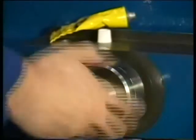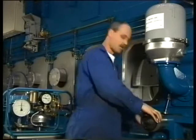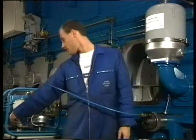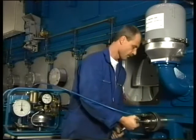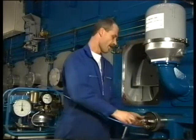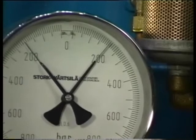This is done to align the bore of the main bearing. Mount the jack on exhaust side. Connect the jack to the pump and check that the jack is in bottom position.